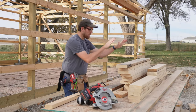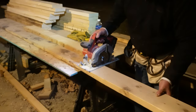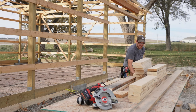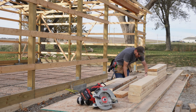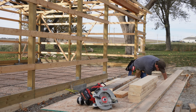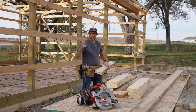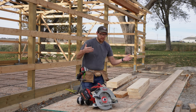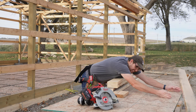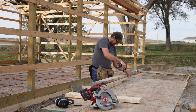My dad cut all of these, pre-cut them to make the window boxes, which are two by sixes. The window boxes called for two by fours, but I'm going to use two by sixes instead. 36 inch and 51 inch — 36 is three feet, 51 inch is because that's three inches past 48 inches, which is four feet. So that gives room to overlap and just butt joint these boxes together. Now there's space to work so far.